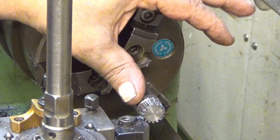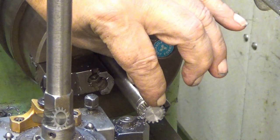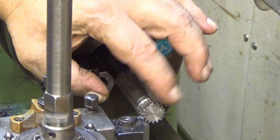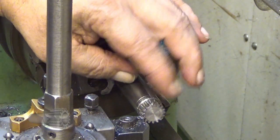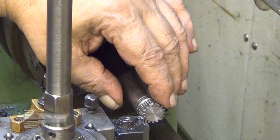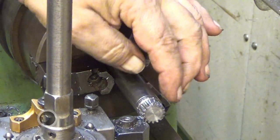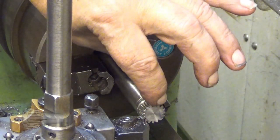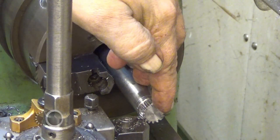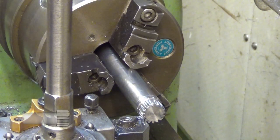So now this is the other pinion. Well, this is a little bit different because it has a longer portion of this 13mm shaft. Well, I can use this area as well where we had gear teeth. I just cut them off, because it will be 13mm. The area will be 30 long, so yeah.